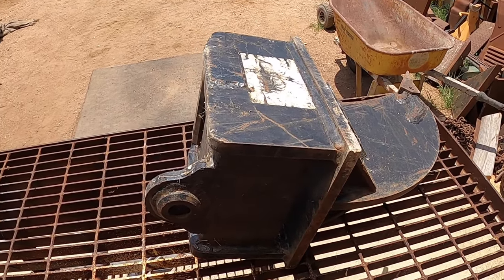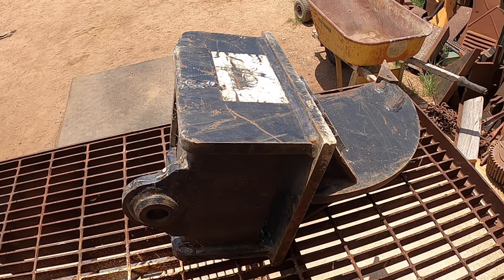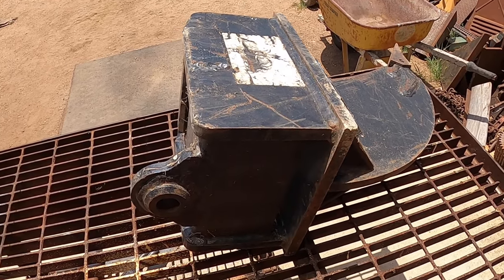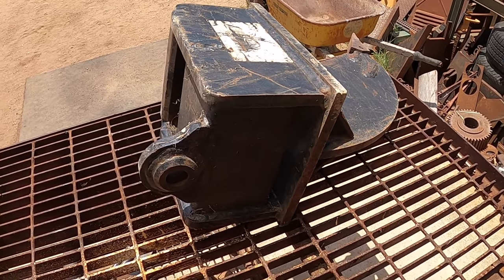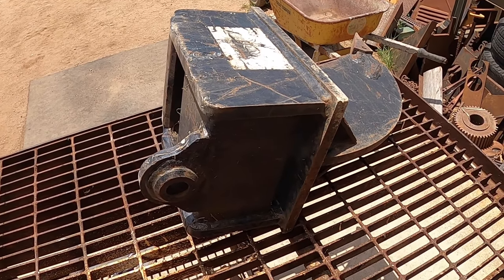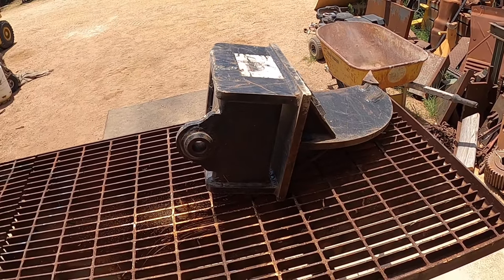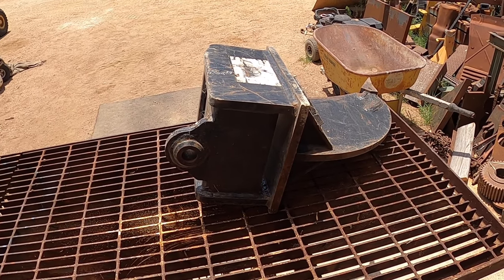Removing these two pieces. And that application works really well in the same sense when there's a crack in heavy thick material: you gouge into the material thickness. That way you can fill it up with weld, and that way it's 100% welded. But here, in this sense, we're removing. So hang tight, let me get all set up, and we'll get started. Here we go.